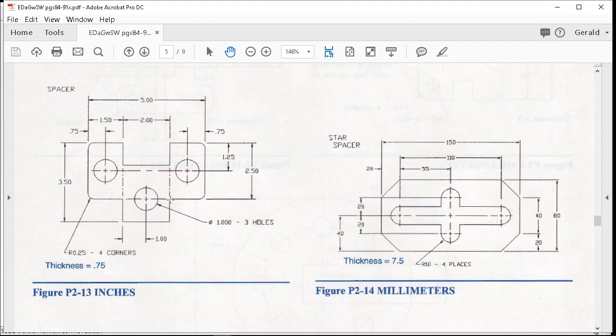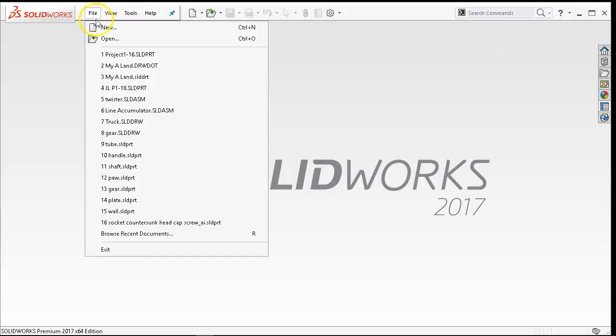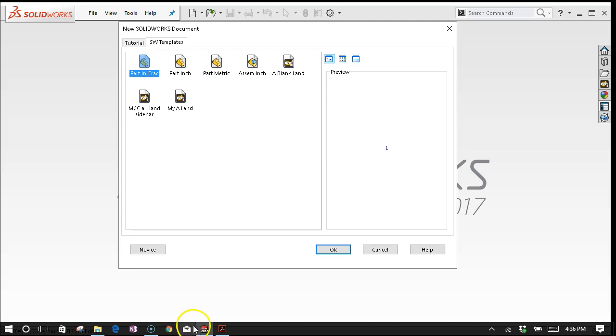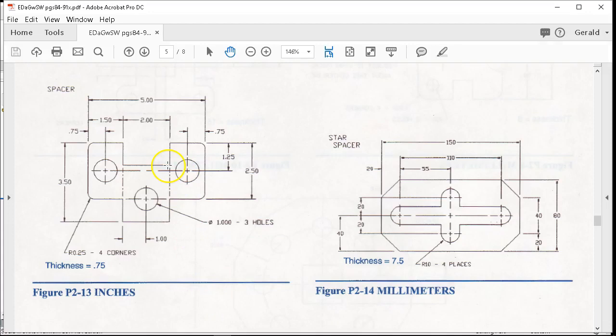So in workflow and company standards, some companies will allow it. Other companies, me, will say, I want to see all of your chamfers and I want to see all of your fillets at the very end. So any of the feature fillets that you create will be the last geometry that you put into your model. And if you're including it in the sketch, then you have to put the extra eye on it as to what kind of effect, potentially where the tolerances will fall out.